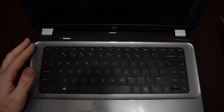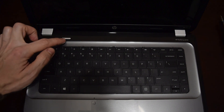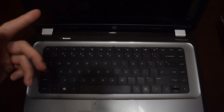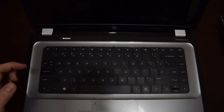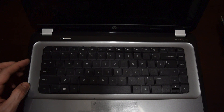Let's start. I'll show you what's going on with this laptop, and then we'll fix it. It turns on, black screen, and as you see the caps lock LED blinks 5 times, which means general motherboard failure. But you already know what caused this failure. Now let's fix it.